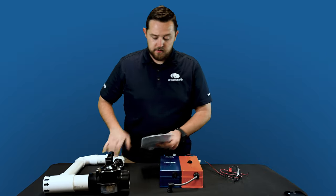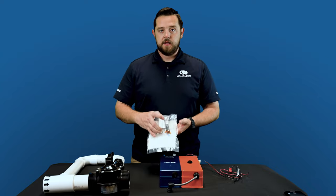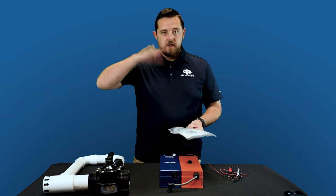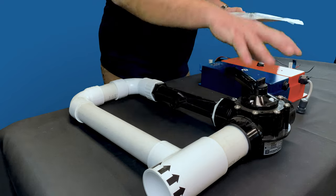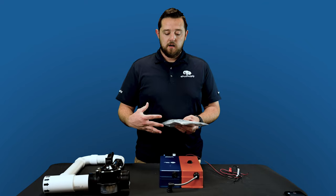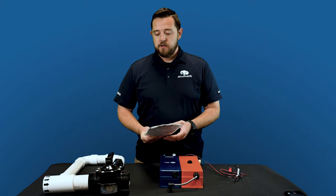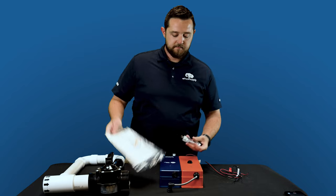Then the next thing you're gonna do from there is, once you've opened it, you have your flow meter installed on the bottom of the blue cartridge, you'll start to see the ball bounce up and down like crazy. As long as the ball is moving, you know that you guys have this open and it's trying to specifically detect that flow. So the next thing you're gonna do from there, let me open this up so I can show you guys a little bit more clearly.